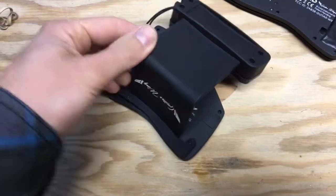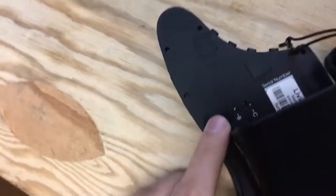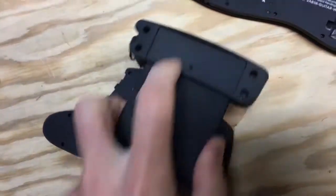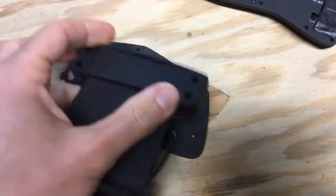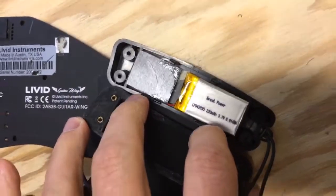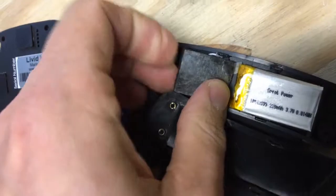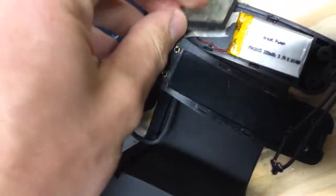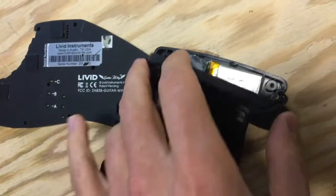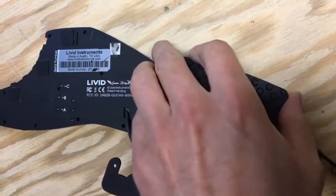This is the one that still has the clamp on it. There are three screws down here around the base — you may have already taken those out if you've adjusted your wing. The ABC markings let you angle the thing, which is pretty cool. There are five more screws in here holding the battery compartment together. That's your battery — pretty sure it's a lithium ion battery, the kind that can do stuff like explode if you're not careful. So be nice to it. Unless you're breaking it open, heating it up, or short-circuiting it, it's not a big deal — it's low voltage.